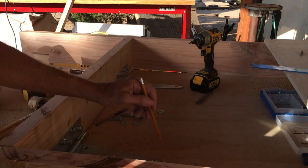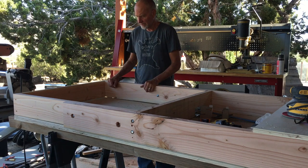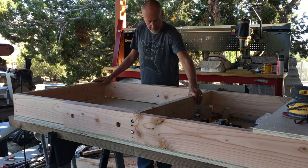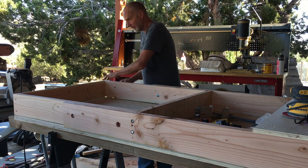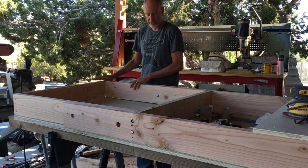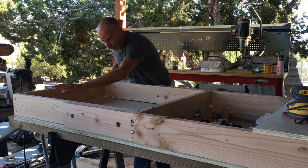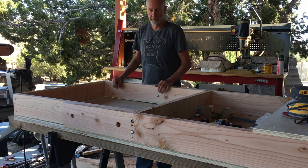I would recommend that you drill some pilot holes here. We built a rear box and now we're going to build a front box and attach it to the rear box to make one big rectangle, and then our frame will be mostly done. This box uses this central pivot point as one end, and the whole perimeter matches the perimeter of the lid so that when we turn it upside down, the lid will sit squarely on it. The rear box outside edges project a little bit forward — we did that because we're lagging these pieces to this piece to give the whole thing some structure.